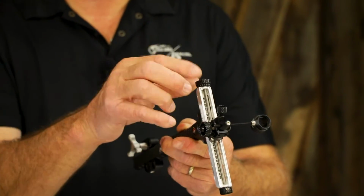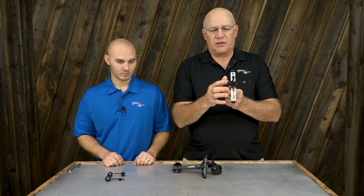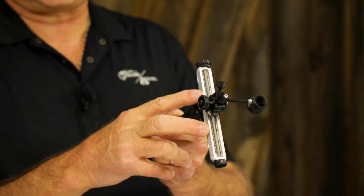You can go one click in one direction, one click in the other direction. There is no slop in the system in either the windage or the elevation. So the other thing we did is we designed, before we started the product, the direction of tension toward the target, so that you don't end up with a screw on the side, two screws on the side, that get it out of balance this way, or a screw on the side where it's pushing over and now all your tension is maintained this way. So after the vibration, where does it end up? Over here a little, or right in the middle. So we designed straight inline tension forward and backward with one screw adjustment. So Tristan, show them on that site what we're talking about and see how that new design system operates.